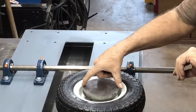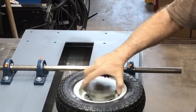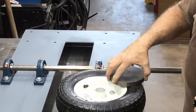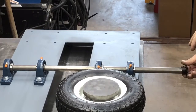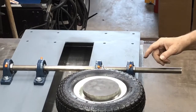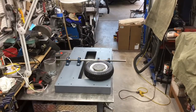This is a 5 inch wide, 1/2 inch thick steel slug. It's just mild steel. So I have to put the bolt pattern in there for these wheels and fit and put a center bore with a key or something. I'm gonna have to machine this bore down to 3/4 for the gears. Yahoo! But that's the next part. Hubs and gears and shafts. Oh my.